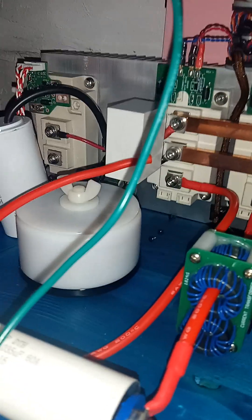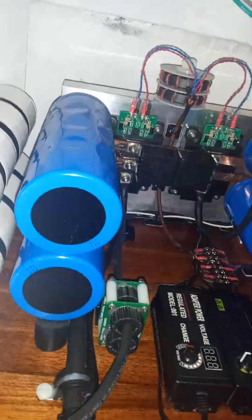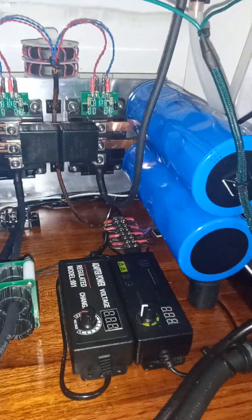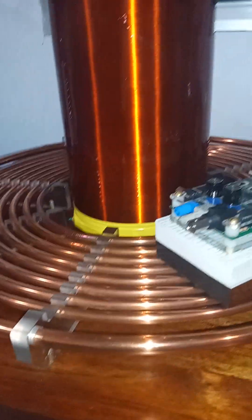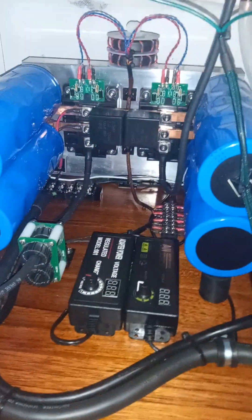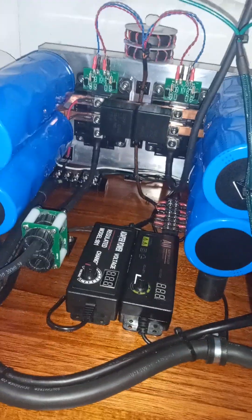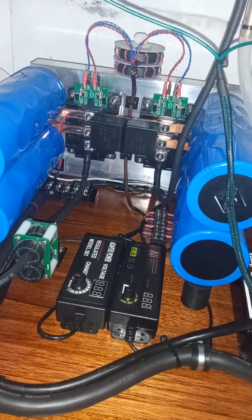As you can see, here's the QCW on a different note. I'm just waiting for the current transformer to get here for my oscilloscope so I can check phase lead — I have yet to do phase lead on this one too, and I'm still getting pretty good output, about 11 feet maximum out of this coil at 680 volts. I've gone up to 2.5 milliseconds, and those little rectifiers do not like it — I'm probably going to have to start water cooling it to go that high. But the transistors are pretty good, they take a beating. I've blown up probably 10 rectifiers in this thing, and the switches are yet to be touched.